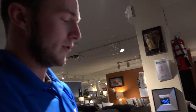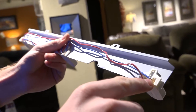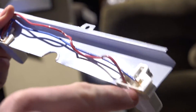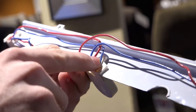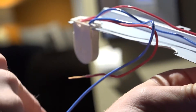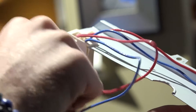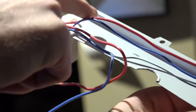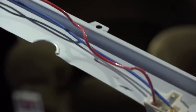Here's what your tombstones are going to look like after they're rewired. I've kept my blues on the right hand of each tombstone — the blue running to the blue here, this blue running to this blue, and this blue piggybacked out to the power supply as the neutral. This is going to be my positive and these are all on the lefts. It's all ready to be installed now.